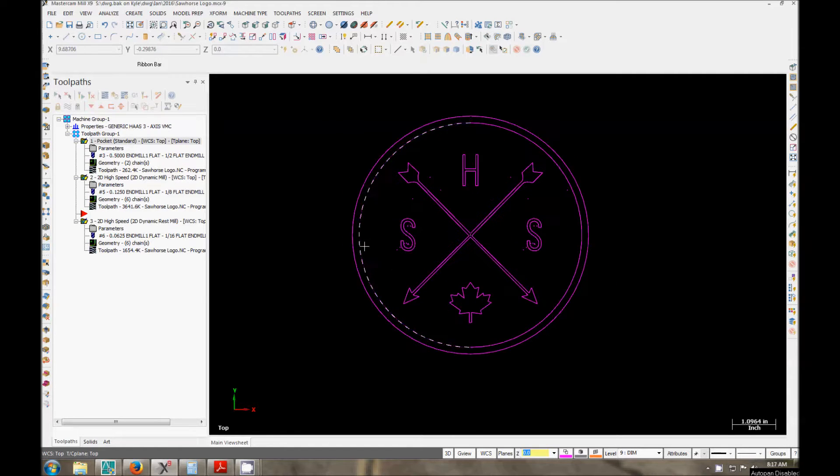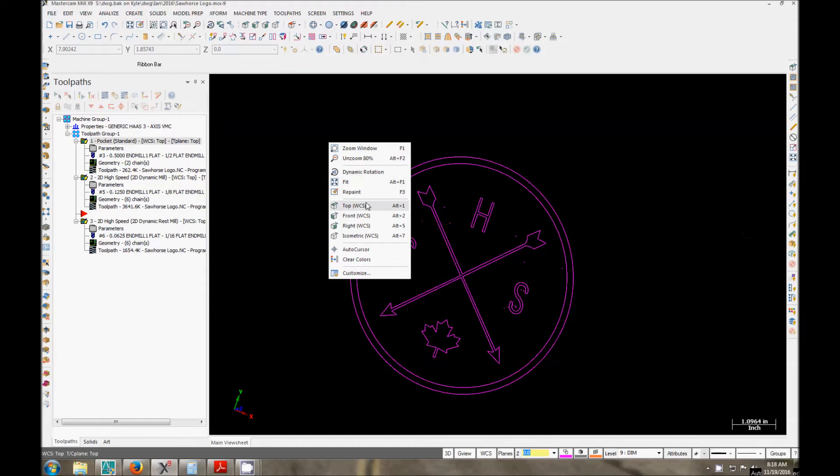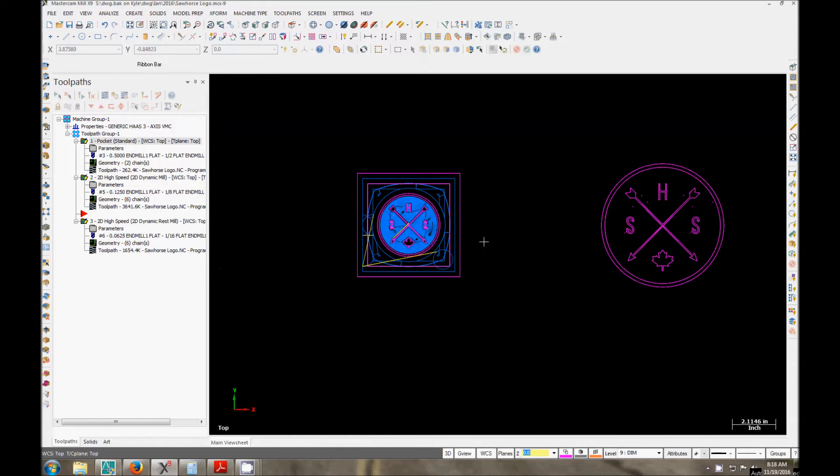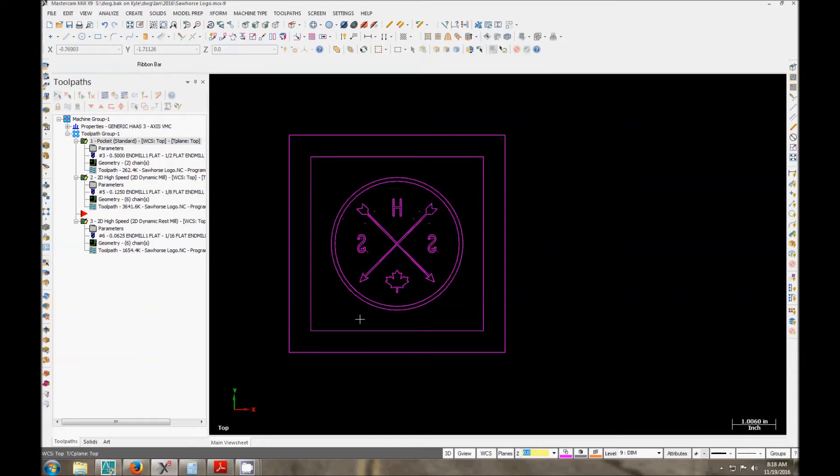Now since this is a brand, obviously it's going to need to be upside down. It gets heated up and pressed in, so if we made it this way it would be backwards. So we flip it around and mirror it — we end up with something like this. Actual brand size is 4x4. This out here is the machining region for the pocket, just to make sure this entire outside area is milled down in case my piece of material isn't actually four inches — maybe it's a little bigger. This way it makes sure everything is cleaned up.